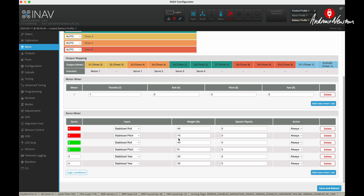I've got the cat playing with my microphone. Conventional wisdom says that you should keep the Elevon mix to 50-50 or a sum of 100, but with my experiments I've found that you can go up to 75-75 without ever over-driving the signal. So you can be a little bit more flexible with your mixes here to get the right amount of throw. On the rudder I just have a stabilized 50% mix — I could put that servo in a hole and have a 100% mix, but I've just left everything on the outer holes to start off with.